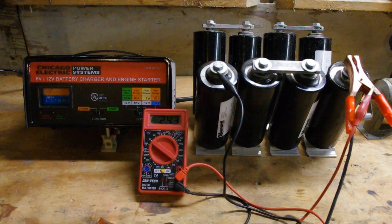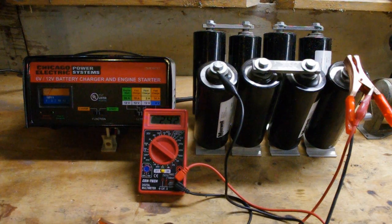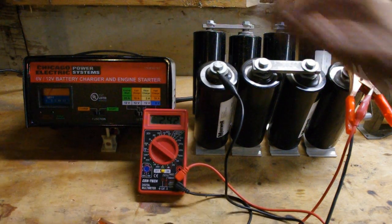To do that, 10 amps would be maybe our goal to shoot for. Just quickly using a calculator — note that if these things are 12 volts, they probably charge at maybe even as high as 18 volts, probably more like 15 volts, and maybe as low as 13.8 volts. So you can never rely on this to give exactly 12 volts.